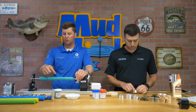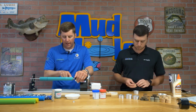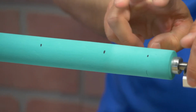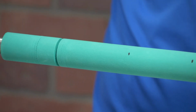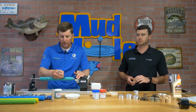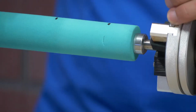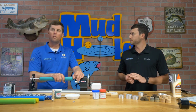I even have it measured out here. You'll see some black marks. If you hit it with a Sharpie pretty thick on some of these light colors, once you've got it lined up, that's at 1 inch to make a 1 inch width. That's a 2 inch width. That's a 3 inch width. So you can take a tape measure, lay it out, drop it in with a little Sharpie. You can darken it, you can lighten it, because eventually you're going to cut on that line, plus you're also going to sand it down. So the Sharpie's going away, and when I hit the gas, I can see right there where those lines are, and then I can cut. Perfect. So we'll show that in a little bit.